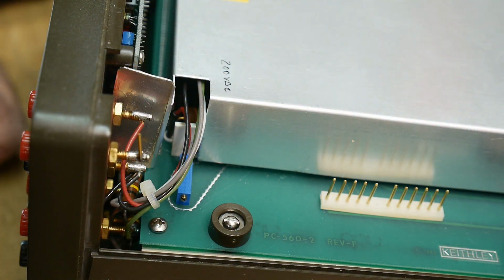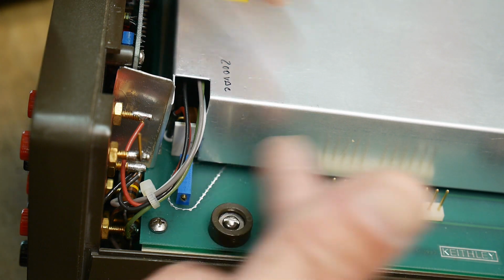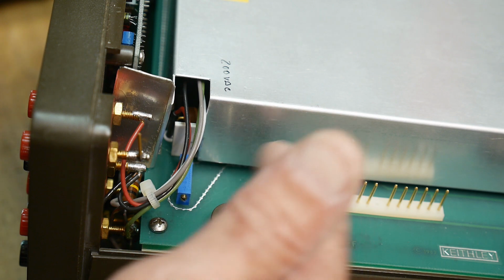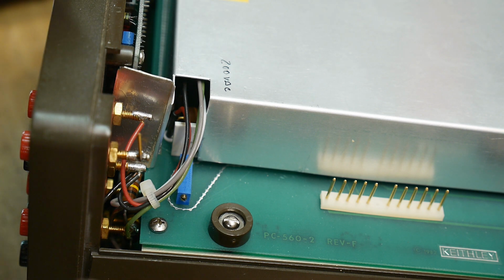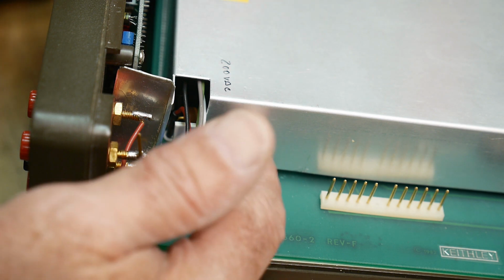All right, for all of those people yelling at the camera, bend it the other way, it needs to be under the shield. You were absolutely right. So, yeah. After a couple minutes I came back and I looked at it and I went, oh, that's dumb. It really should be the other way around. So I've bent the aluminum out. So now that fancy resistive divider is underneath the shield. So it was under the high voltage side, so it wasn't going to pick up much noise. It didn't really matter either way, but this makes me feel better. So, yep, there you go. It's in the right way.